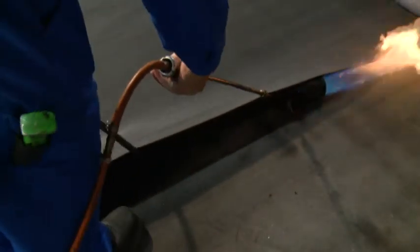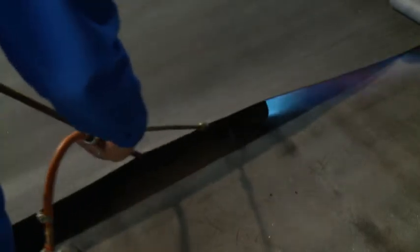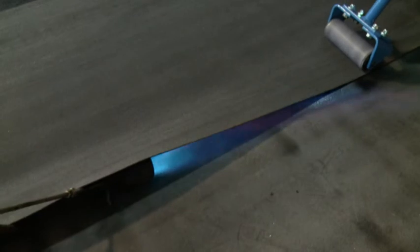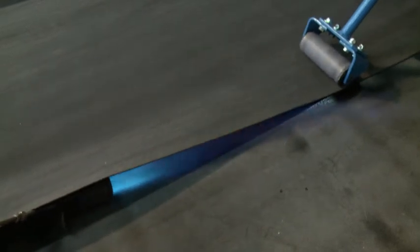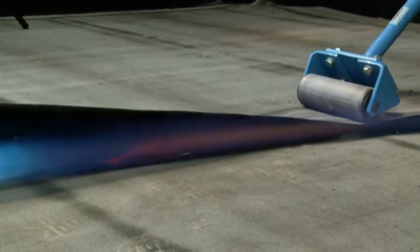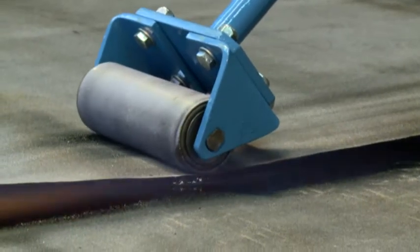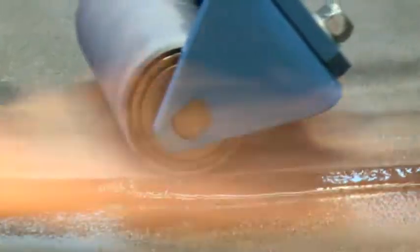It is common practice to position the rolls with the correct overlap distances prior to welding. To execute the weld, lift the upper strip and heat both parts of the connecting membrane, assuring that heat is strong enough to melt the bitumen for correct and full bonding. The heavy roller should follow directly after the hot weld so that the bitumen does not start to solidify.